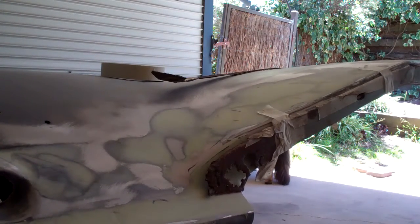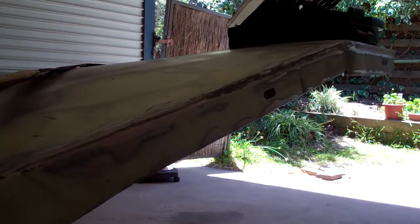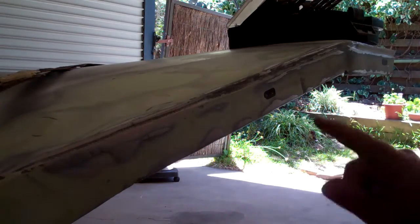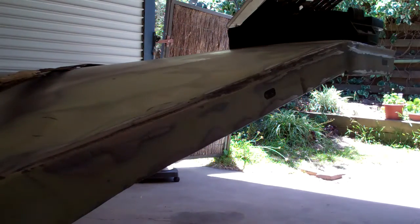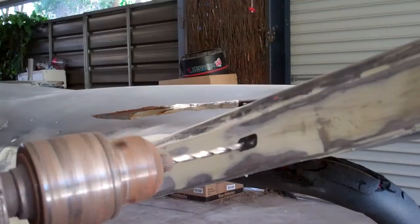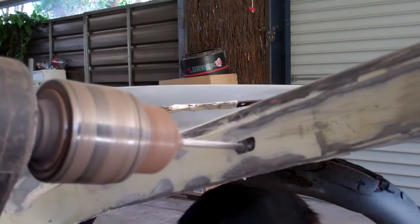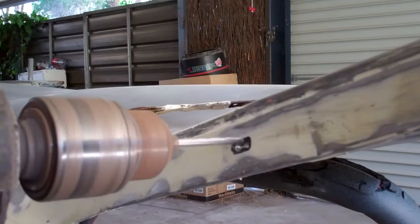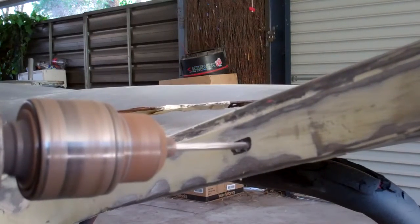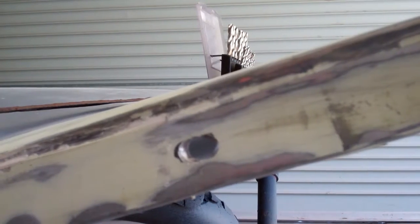Then it's just a matter of drilling straight through there and putting my chrome pieces on. Unfortunately there's no such thing as a slot drill for this, so you've basically got to drill out two holes and then push the drill to one side to elongate it and make it a nice wide slot. The hole is about an eight-and-a-half diameter drill, so I'll start off with a smaller drill and work my way up. So that's one slot done — now I've just got to get in there with a round file and clean that up to make it look a bit nicer, and then on to do the next three.